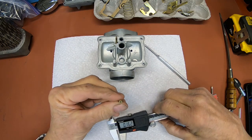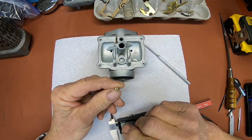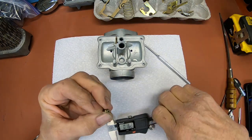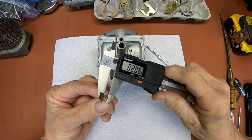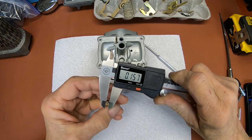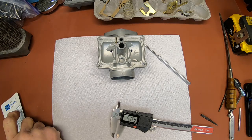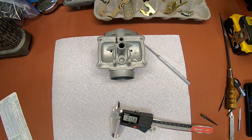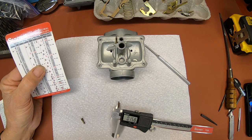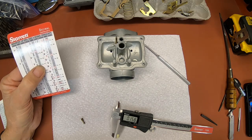Well, I tried that a little bit and I was getting some little flakes of metal out of it, but it really wasn't acting like it was going to work. So basically, if you look at this, it's .157, and the .157 is just a little bit over 5/32nds. You could use a number 22 drill also — that would put you right on .157.